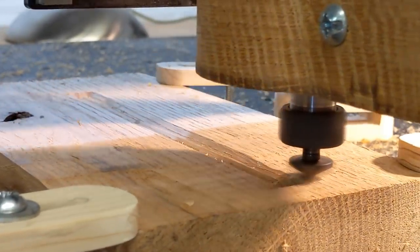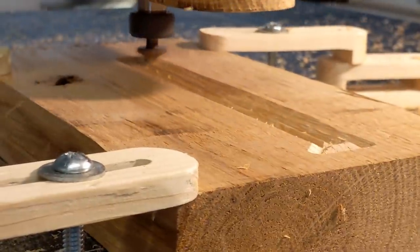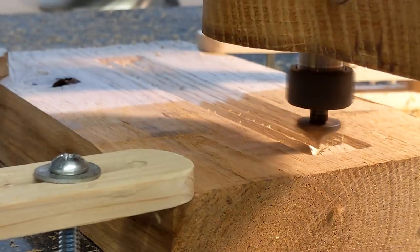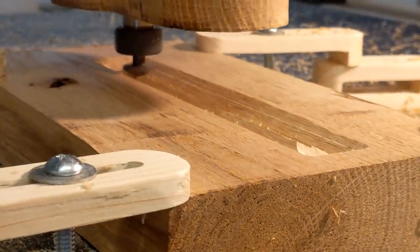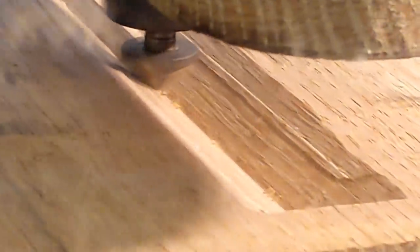You see it's ripping right through that material. I totally recommend a 120 degree V-bit, especially when you're doing larger letters. This is also stocked on the IDC store. What I want you to see here is the cut it's going to make in just a moment. You see it's just rolling right through that material. Very thick cut. Watch this next cut. How much material it has taken out.